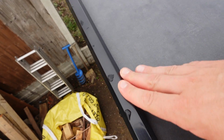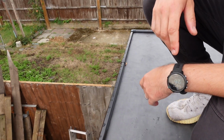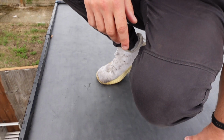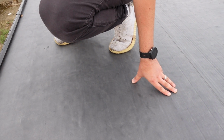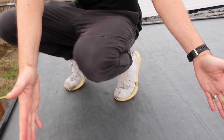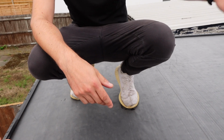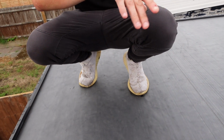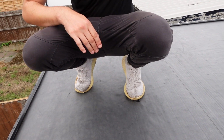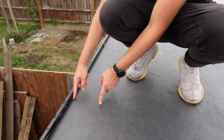I like this trim. Yeah, so it's all part of the same kit. And basically, it's so easy to do. You do the rubber cement, which dries really quick in the heat, so you've got to work fast. So I was working at probably about this much at a time, rolling it out, leaving it as a roll, painting it on, and then rolling it down, and then sweeping it down, working from the centre out. So back half first, and then this half. Smart.